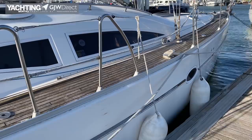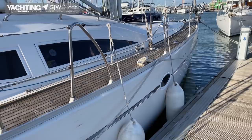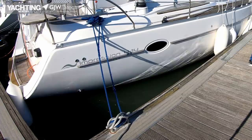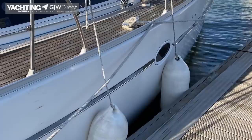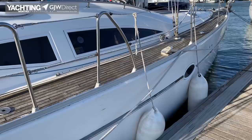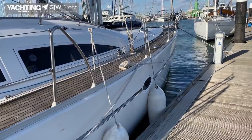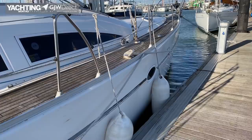We've got a typical boat on the dock and we're going to look at how it's been rigged up and what the various lines do. Most of all we can see there are four lines: we've got two breast lines, one at the bow and one at the stern. The breast lines are there to stop the boat moving sideways away from the dock. You're then going to have two spring lines — one running backwards which stops the boat going forward and one running forward which stops the boat going backward. If we just let the boat sit there for a while — there's a bit of wind today — you'll see those spring lines coming under load and doing their work.